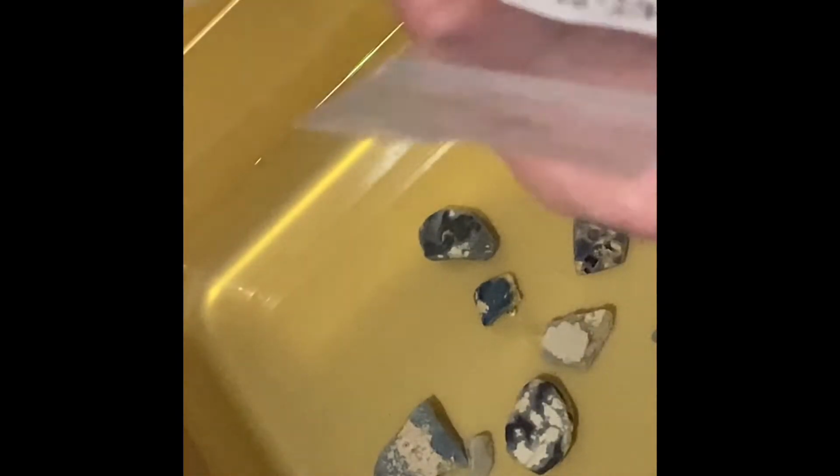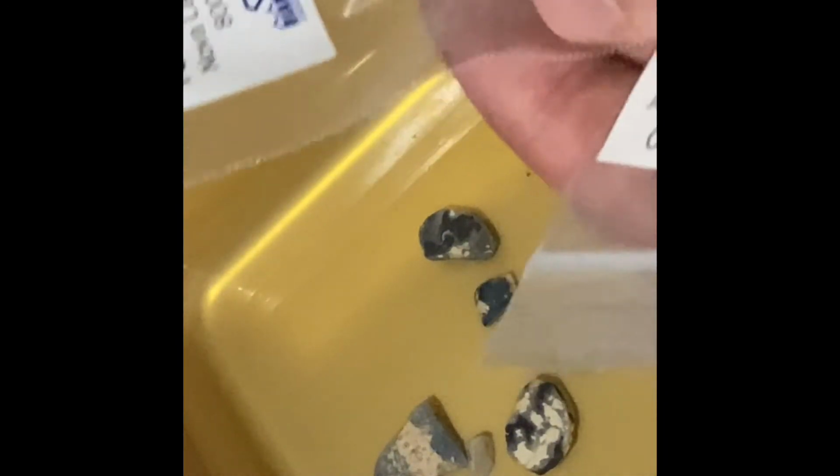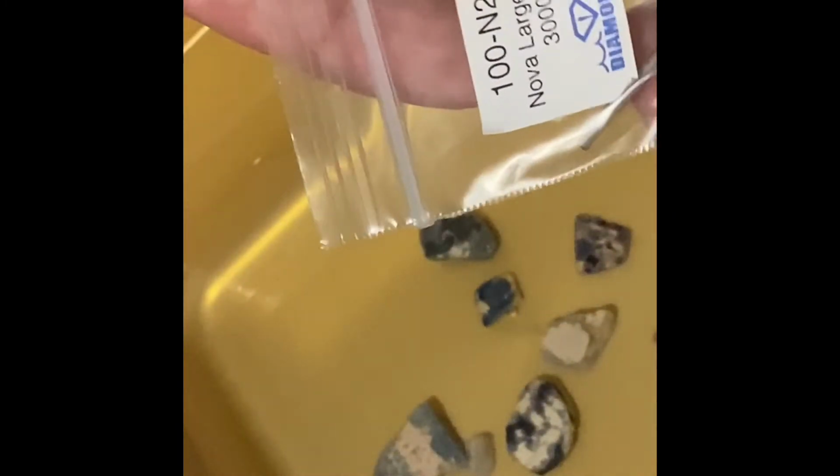So I got the 280 grit, and I got the 600 grit, I got the 1200, and this is the order I would probably use them. Then 3000 and 8000. With the 8000, you can get a really good fine polish with some cerium oxide powder mixed with water, by dipping into the water, and you've got to keep these wet. These tips, you have to keep them wet. This is the 8000, the tan color there. 8000 gives a great polish. The 3000 is good to use before the 8000. Then step up to that 8000 and your polish will be nice.